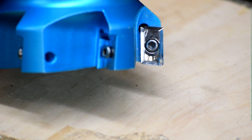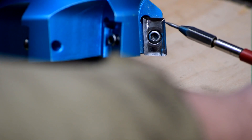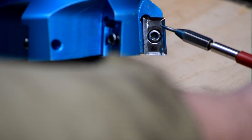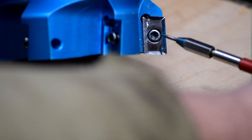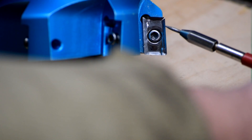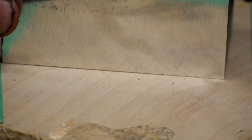Here's another example. This is a face mill that I featured in another video — one of the first ones I ever made as a matter of fact. This one's got a highly polished surface with a lot of that scoop profile and really sharp edges along in here. This thing cuts through aluminum like butter and it leaves an absolutely beautiful mirror surface finish.